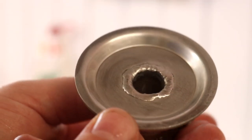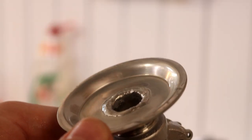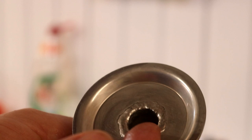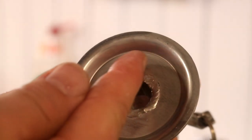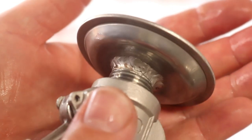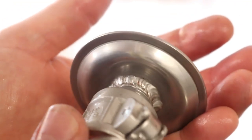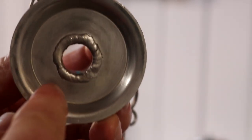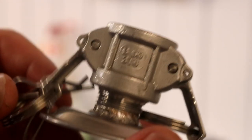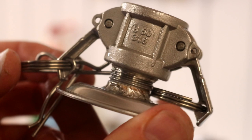Let's put it against a white background and have a look. That's the weld — you can see it's slightly proud because the threaded fitting was sticking through a little bit, but we've flowed all that extra stainless filler metal all the way around the hole. On the other side you can see a lovely welded seam with no coking whatsoever, and even though the hole is slightly off-center, you really cannot tell. That is a cam lock fitting, ready to go into action.